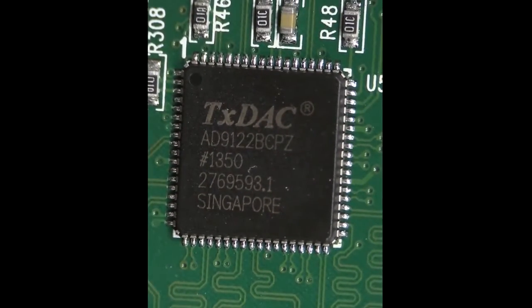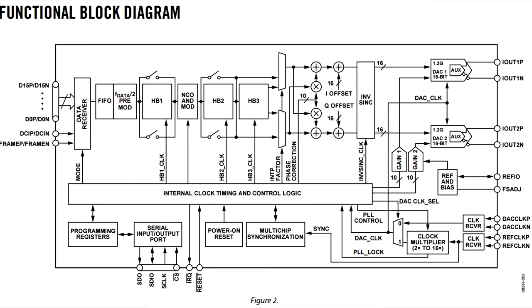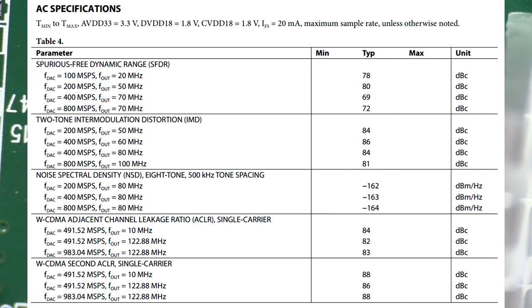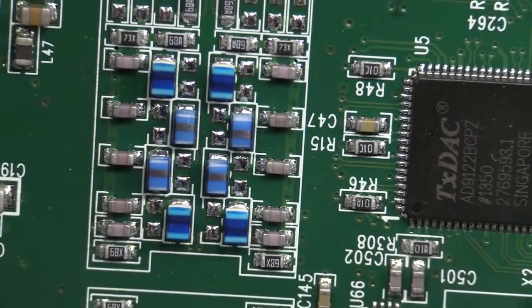Well, here it is, and yes they're not lying. It's a TX DAC from Analog Devices — it's the AD9122 — and it does the business as it says on the front. This is a dual-channel 16-bit DAC, high dynamic range, 1.2 gig samples per second. This puppy goes for about 60 bucks in 2,000 quantities — it's not a cheap chip that you design in willy-nilly. In terms of power consumption, this thing takes about one and a half watts on its own operating at the full one gig sample per second. It really is a very professional, high-end DAC — I'll link the datasheet for all you DAC aficionados. They're not lying, it does the business. Looks like we've got some anti-aliasing output filters next to it — that's what you'd expect. All discrete. The little blue parts are inductors — you can see the windings on those. That's a complex network if there ever was one, and there are two of those — two identical networks.